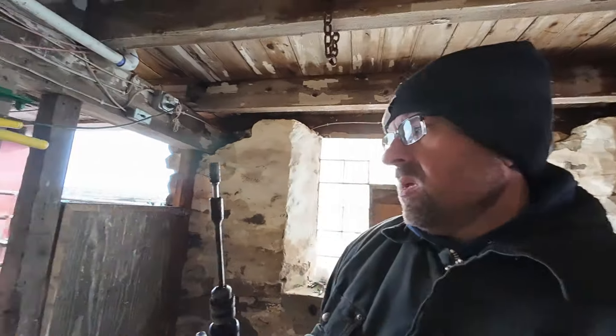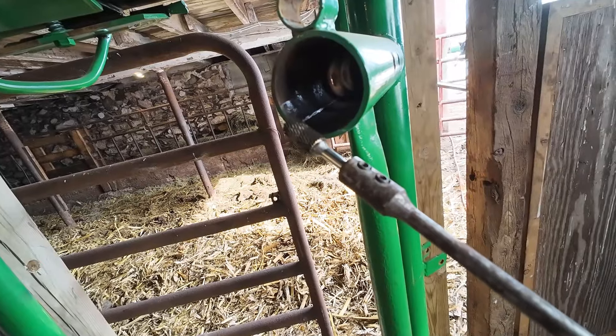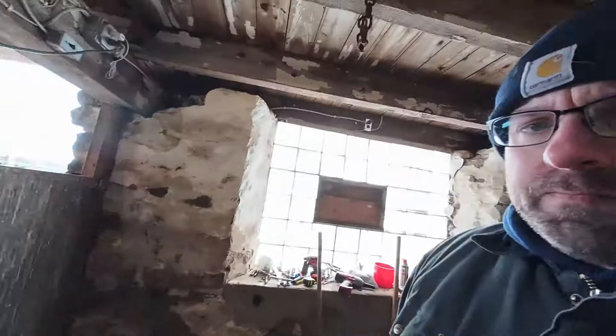I got the air compressor running. So it looks a little goofy, but I've got this in our die grinder - our air tool - and we're going to try this out in here. I tried it a little bit the other day, trying to grind that weld seam down a little bit, just so that these pipes hopefully flow back and forth a little bit nicer. I wanted the air tool because it's got a little higher RPM. So let's give it a whirl.